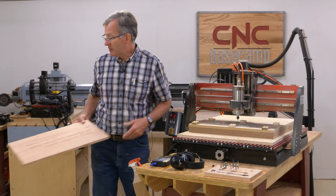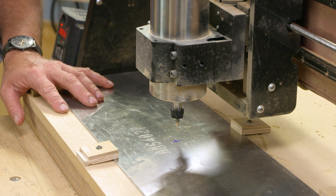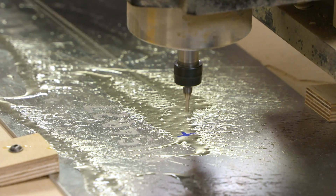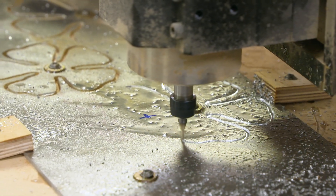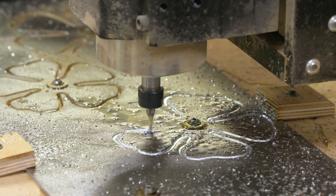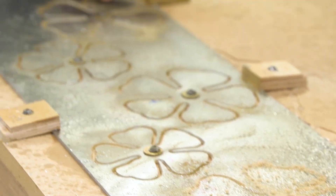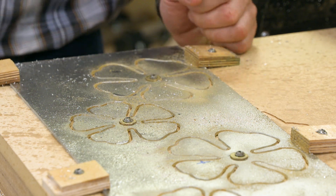With this done, I'm going to switch over to a different machine — I typically use this one when I cut metals, because there's a little splatter with the oil and I'd rather keep that on one machine. I have a piece of eighth-inch general purpose aluminum, and I'm going to spray a little oil on the surface, fire up the spindle, and get started cutting some aluminum flowers as accents. Tabs are a great way to hold a piece in place while you cut all the way through, but tabs also have to be cleaned up. So what I did here is, once the machine cut the center hole of my flowers, I used a pocket hole screw and a washer to clamp that flower down to my spoil board — no tabs needed.